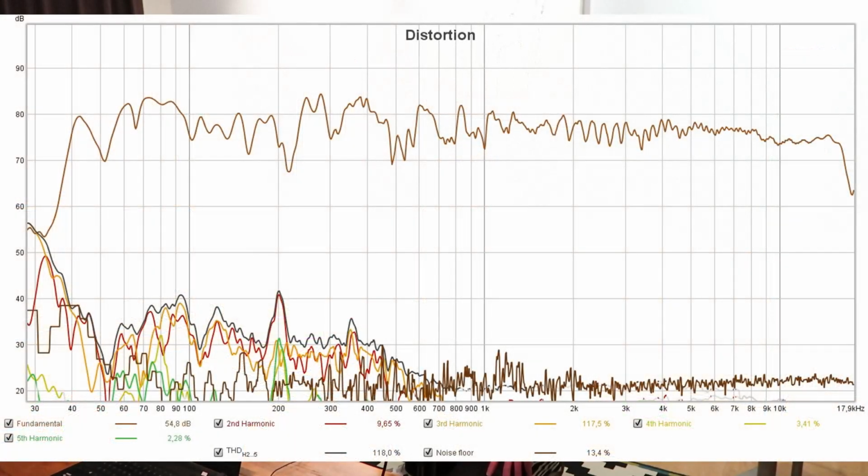In the distortion plot up here, or that's covering my face right now, you can see where the woofer stops playing, since all the distortion is there, and then it's just flatlined, sort of. Not completely, of course, but you can see quite the difference between what driver is doing what in the frequency range just by looking at the distortion. So I'm gonna play two tunes.